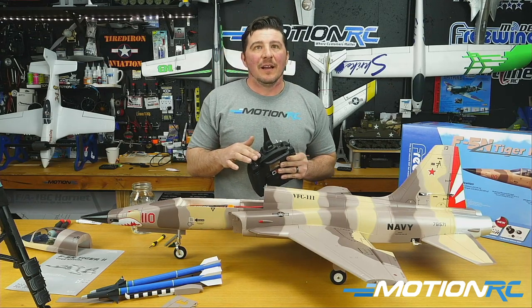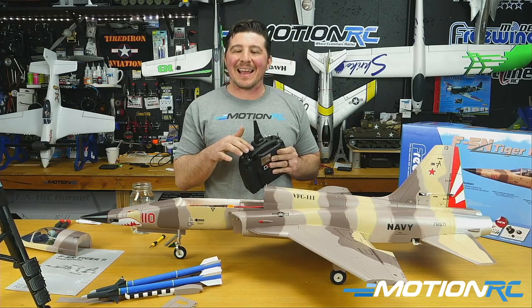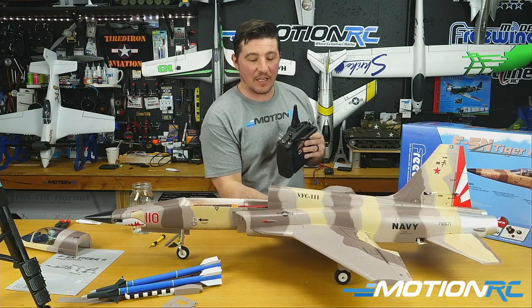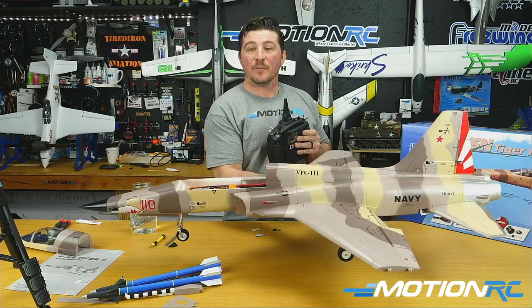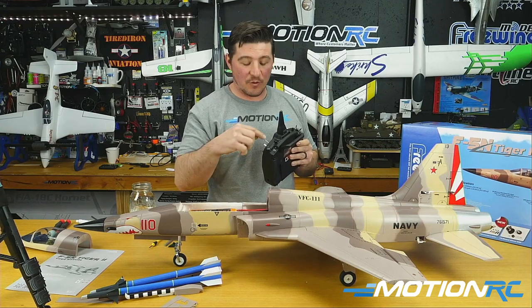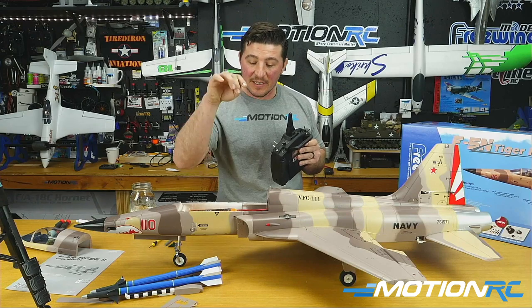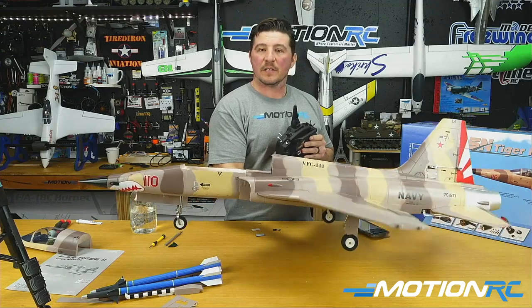So I've run into questions where people said, I plugged it in and I'm not getting any response. And I think the answer is, if you happen to have this knob all the way down, you're gonna have a very low, almost no response. Like right now, my gyro is on, but I have no response. Now, where I set the pots manually is gonna determine my max gain. So if I turn the knob to its max level, it'll be the max level on the pot. So now you see the gyro's working.